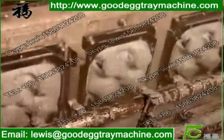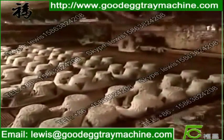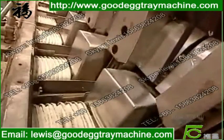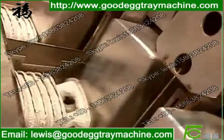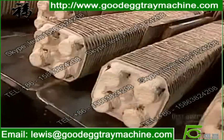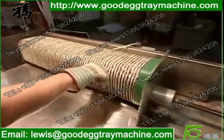The factory uses the identical molding process to make four-cup drink carriers. These too go into an oven to dry out the pulp, but only for six minutes — half the time the filler flats need — because this product is smaller and lighter. Automated compactors stack the finished drink carriers, then workers compress them for packing and shipping.